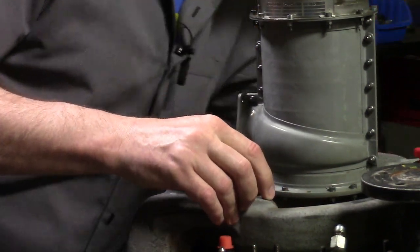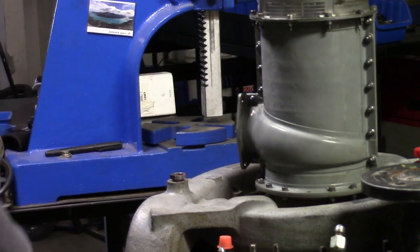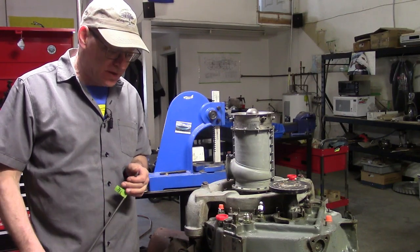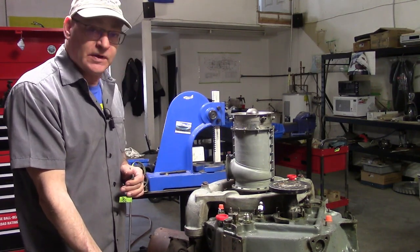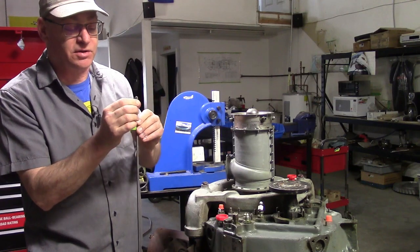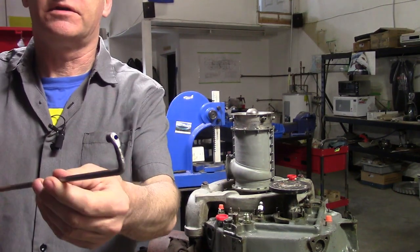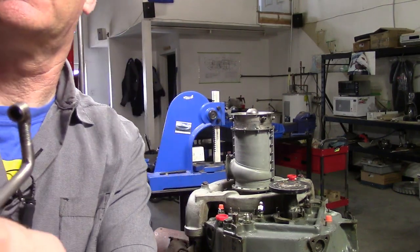What I built, back in the day - we had a nearly impossible nut to reach in the LM500 build, that was five or six years ago, a long time ago. We had to reach down a hole and undo a 7/16ths nut from the back. So we made this monstrosity. It has a square drive male on it - that was our mistake. I think we turned it with a crescent wrench, a strut across, then all the way down. We bent the end of a steel rod and put the end of a 7/16ths box wrench in there.